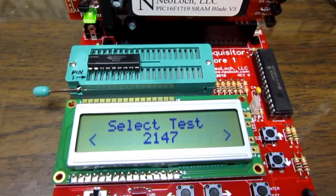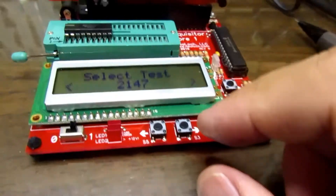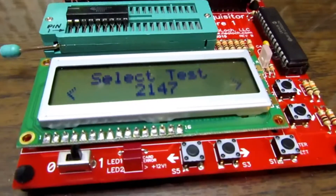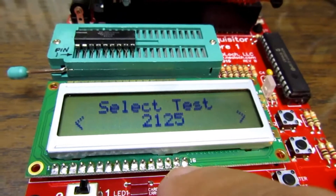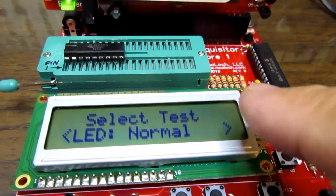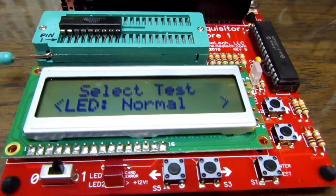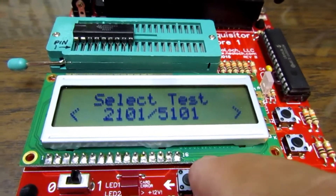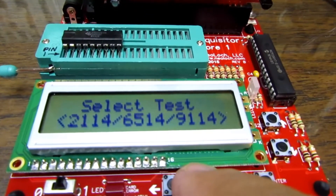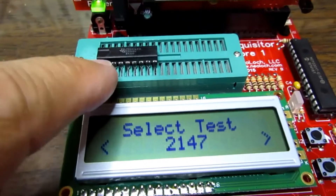The selected test comes up. The 4044 is not specifically mentioned, but it's essentially the same as the 2147, and I've already got that one selected. By using the left and right arrows you can navigate through all sorts of different types — there's even a setting for the status LED if you prefer the colors to be flipped, which can also compensate if the LED was installed backwards. Going forward there are 2101s, 5101s, 2016s, 2018s, 2114s, etc., which is what I've got here in the equivalent 4044 chip.